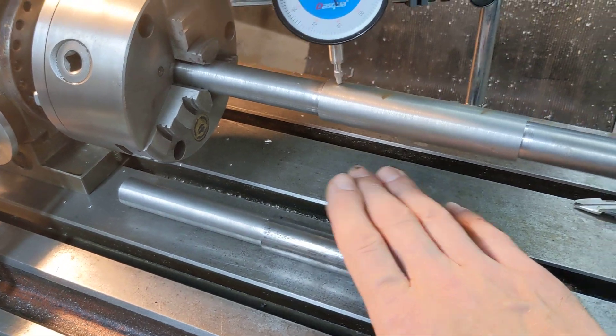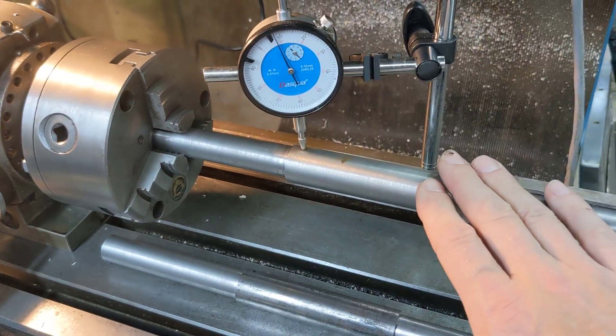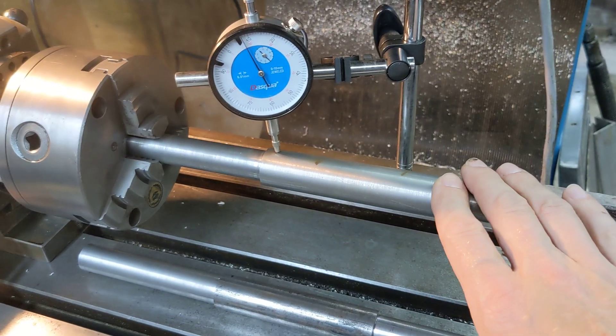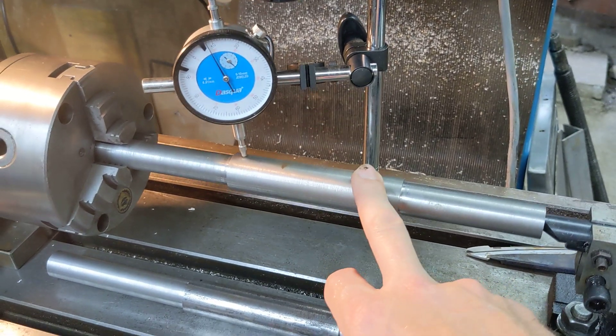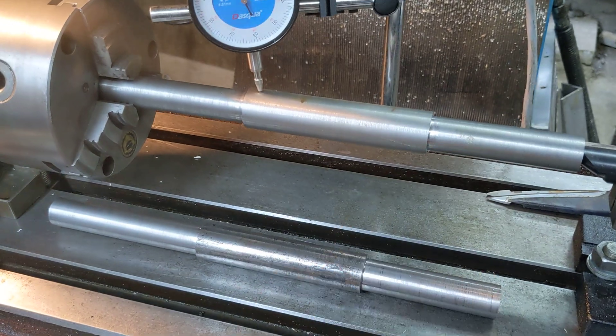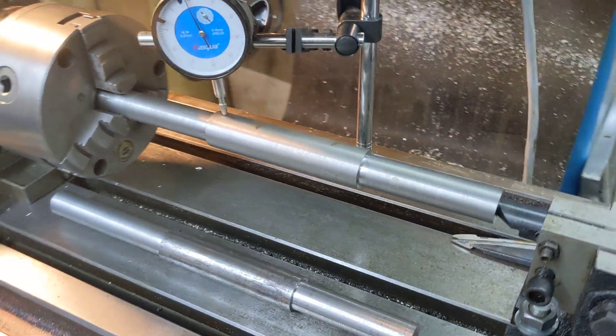By running the program on this job which is to size, we can measure it and do a test fit. Then we run it on the real piece which is slightly oversized, because as we've discussed before, the heat treatment may warp it slightly and we grind it to size afterwards. So we can't do a trial fit on the actual job, but we can do a trial fit on the test piece — and that's what we intend to do.